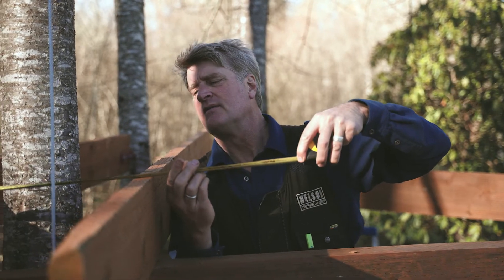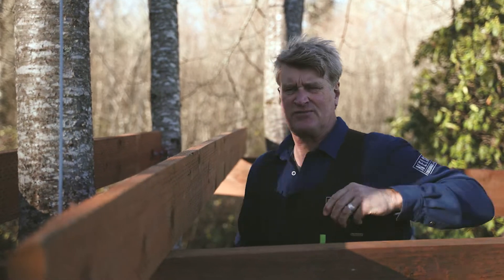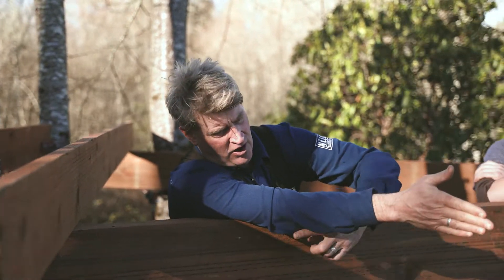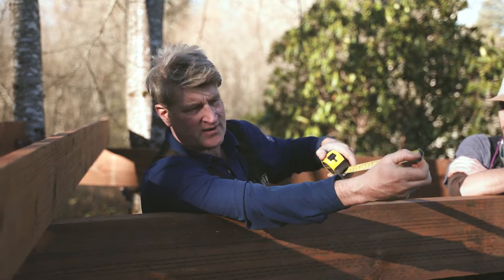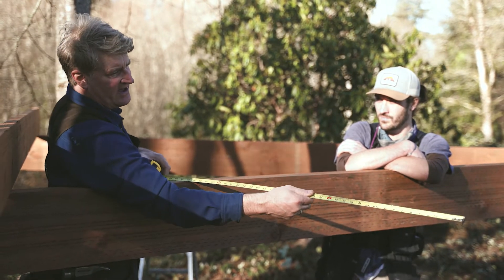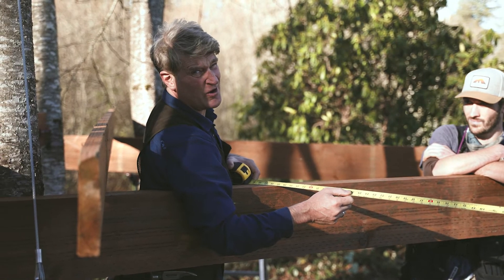You're going to see I'm going to stay six inches off of this tree to allow for growth and movement. These joists are now only 18 inches apart — that's pretty good. And this is what's fun about building your own treehouse: you can kind of create on the fly. I want to make sure we don't cantilever too far off the beam. Dealing with wood of this size, I would say three feet is as long as you want to cantilever off a beam like that. I'm going to show you exactly what three feet looks like. There would be a little bounce if you were standing out at the end, but that's about the limit — three feet.